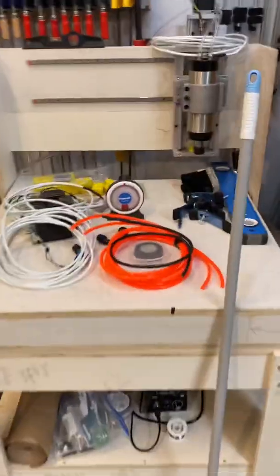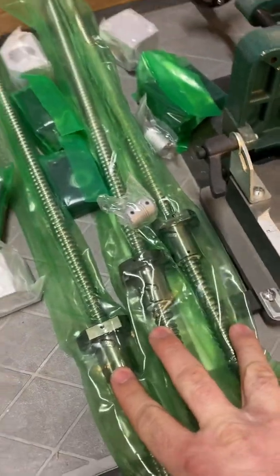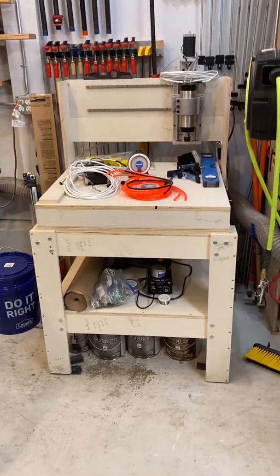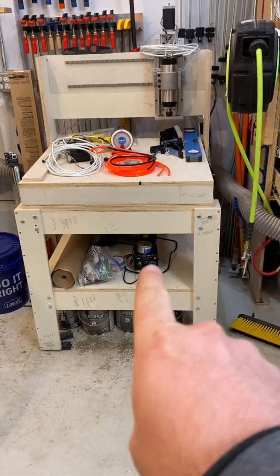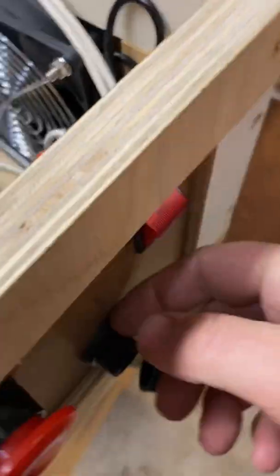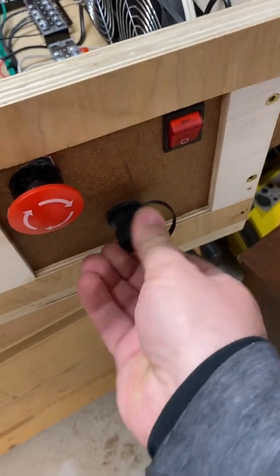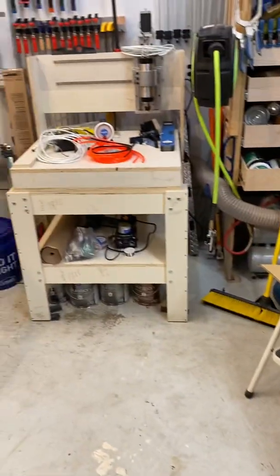Let me show you what came in today - it was supposed to arrive Wednesday, so I'm really excited. I got my three ball screws, so I'll put those together tomorrow. Hopefully I'll actually have a moving machine tomorrow. This is the CNC down here - that's where the controller case is going to go. The switch will be here, the emergency cutoff here. This right here is actually an Ethernet port for the computer, because that's how the Smooth Stepper connects - you just plug it in externally with a dust cap.